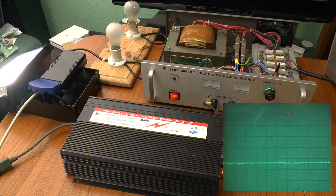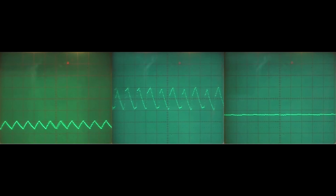The power draw seems to have levelled off now at about 13 amps, and it's quite a smooth draw as well. We haven't got that nasty sawtooth wave. Here are the scope traces again showing the current input at 13.8 volts.